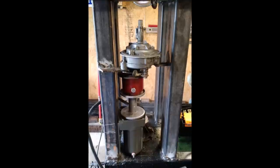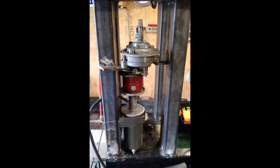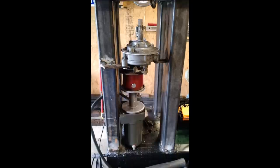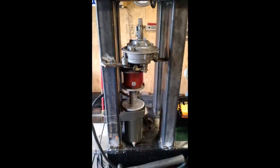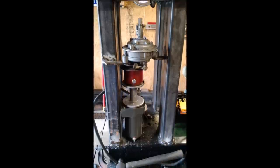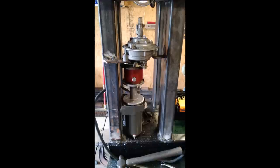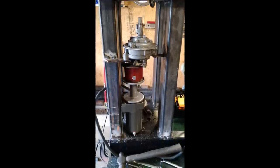Another little trick — that's actually a moped transmission from a Honda Hobbit, more junk we had laying around. We used it to reduce the gearing so when it's twisting the tower around it doesn't move as fast, because it was quite fast by itself. Those little Harbor Freight winches have auto brakes but they're too quick for the swing of a boom, so that's why we reduced it.